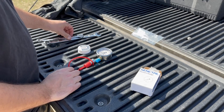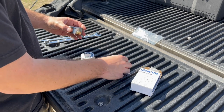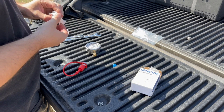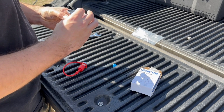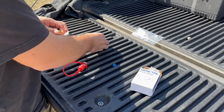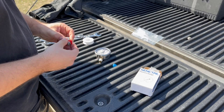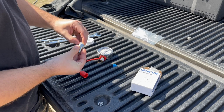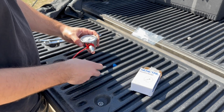I've got a couple wrenches together, so I'm just going to go ahead and throw it together. First, I'm just going to pull the cover off here, apply some thread tape — and I've got to make sure I put it on in this direction, so that as I put on the connector it'll continue to push the tape into the threads. From there, I'm going to take this cover off and put it over there so that it locks on. Then I'll take out this little plastic cap and just start threading this on.